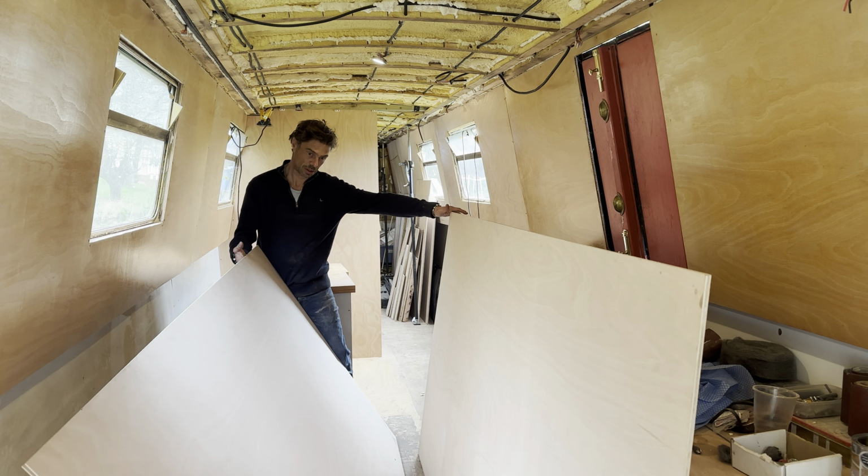Even though this is rigid as you like, now it's all been glued and screwed together, on this piece I'm going to go for bigger uprights. I'm using CLS as the uprights because this is going to have the sink on it, so it's going to be a bit heavier. That's basically the main reason. The upright here and the upright round the back there are going to be hidden. This one's going to be hidden by the shelvy unit bit that I've got to do there, and that bit there is going to be eclipsed by the fridge. So on these ones I'm going to be able to screw them straight in, as opposed to this one here, where I had to glue it all together. I can screw those 2 in, which can be a bit of rigidity when I offer it up.